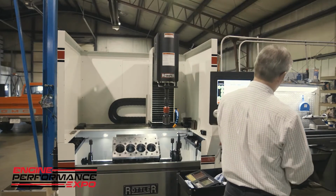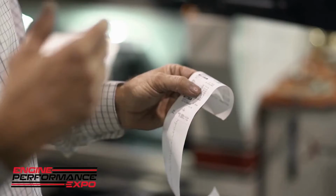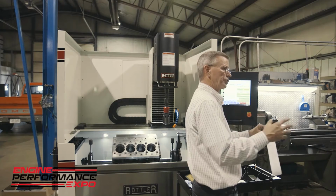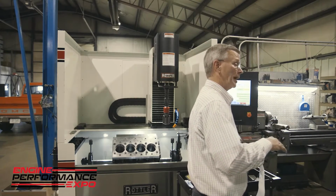So here's a perfect example. We have a 14.5 on our RPK, which is right in the middle of our range. We have a 73 RVK now. So you could see we started out in the first cylinder, we were at 32 strokes at 25% pressure. And we were at a 54, I believe it was. The next cylinder, we maintained our pressure, but we went down in strokes. We dropped 10 strokes. We came up 10 points on our RVK. The third cylinder, we dropped our pressure to 20%, dropped our strokes from 22 to 18, and now we're at 73 RVK. So you can see how you can adjust by strokes and pressures when you're plateauing. And again, the critical thing is to do this before you reach final size.